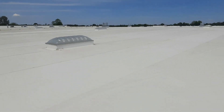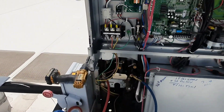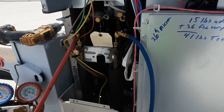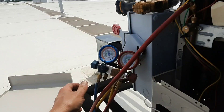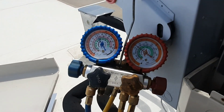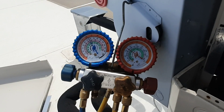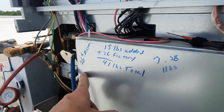I'm gonna tell you, it's a long way up. I'm no VRF guy, but you can hear the hissing — the usual low charge sign that you hear on a walk-in box. It's easy to hear. It's trying to keep that head pressure up. These numbers look okay, but this guy's gonna be low on charge.